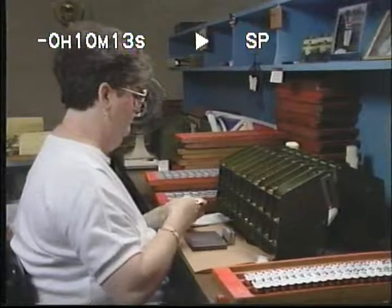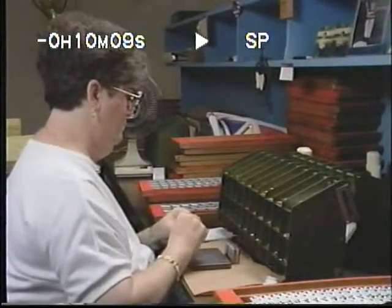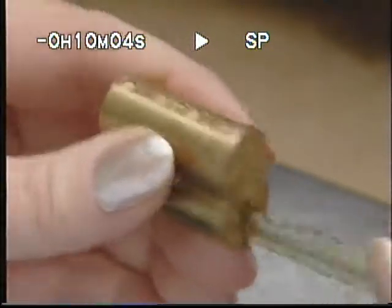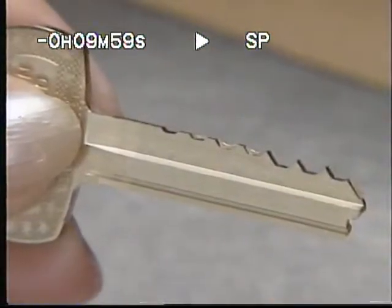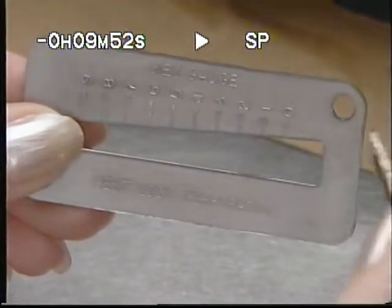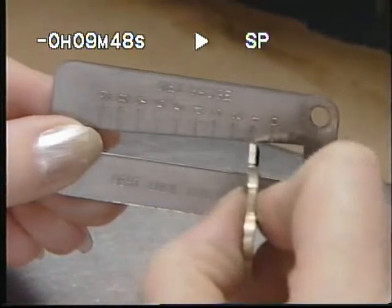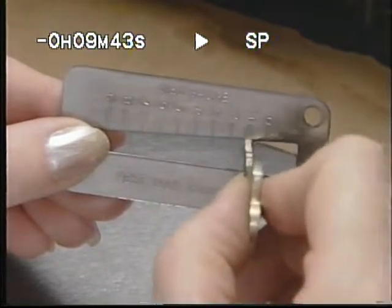Once the core has been combinated, if it is not operating correctly, here are some troubleshooting techniques. If you find that the key is not operating the core, it may be that the key cuts and milling may have burrs. Check all of the key cuts and brush the key with a handheld wire brush if any burrs are present. Another possibility to consider is if the key cut is not correct. Use the key cut indicator to check that the proper key codes were cut. Re-cut the key if necessary.